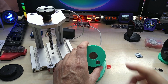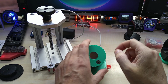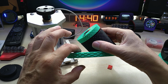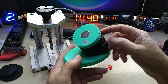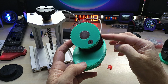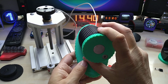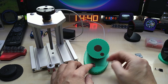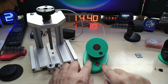Although I also want to actually use nice metal buttons with LED rings in them, but if I put it on here, I would have to make this thing like 3 times as deep, and just for a switch it does not make sense. And to put a switch on the back or on the front or on the side, it would not look good. Plus it's a curved surface, so you have to have it recessed, and it's just a whole bunch of problems. The best way to do it electronically, well, it's a mechanical part in there, but no mechanical switch, just touch sensors here on the bottom.